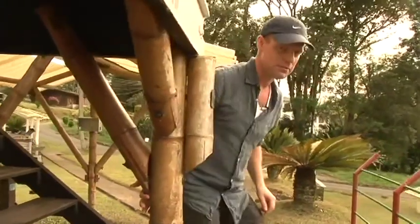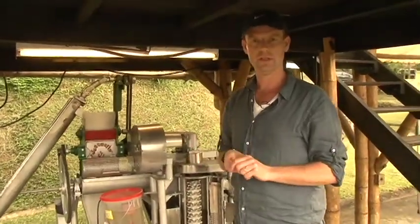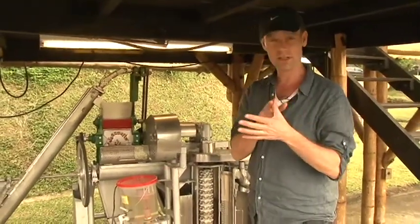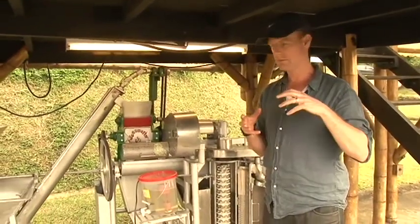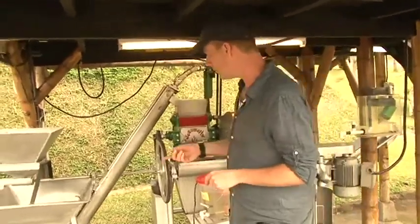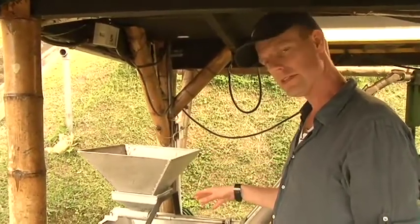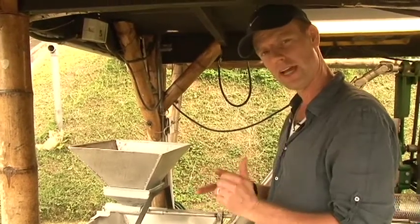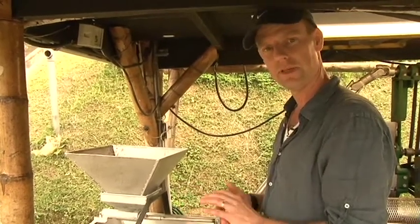As promised, we are also here at the eco aqua pulper — the 'Big Cold Soup.' Let me go through that with you. Basically it's an economical aqua pulper to save water, help the environment, and save time, so there are plenty of benefits from this method. First of all, if you come over here, there's a water tank where, before the cherries get to the pulper, we remove the floating stuff — the branches, the leaves — and the stones sink to the bottom so they don't end up in the pulper.